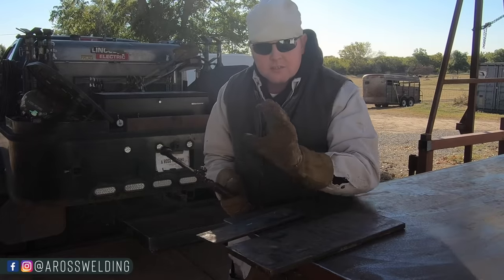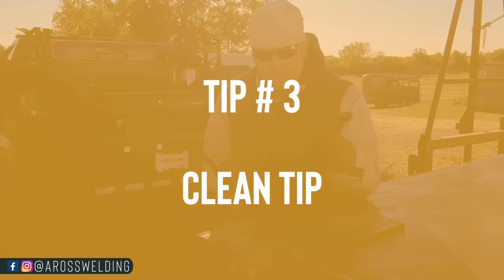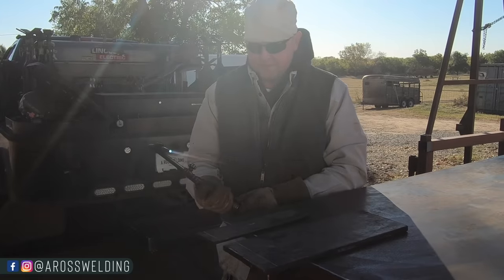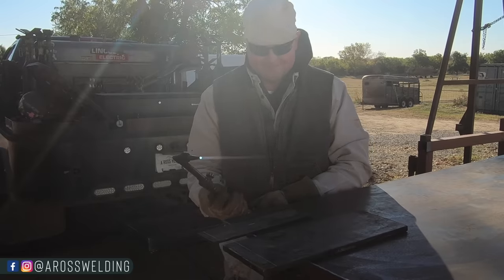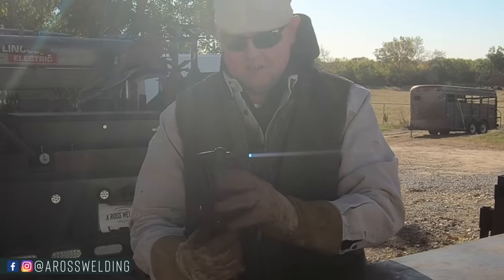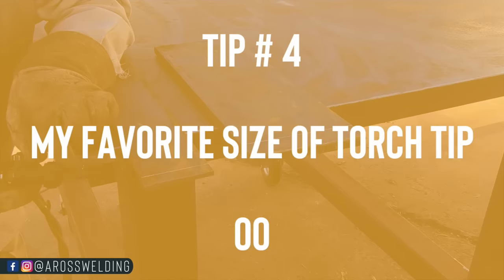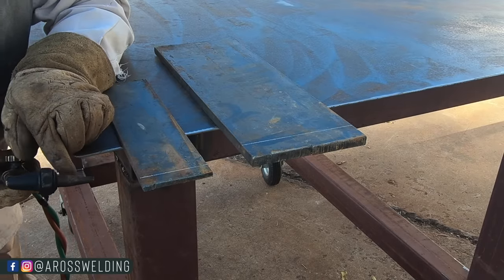Tip number three is one of my most important tips that I give anyone, which is a clean tip. That's going to save half your trouble all the way around — a clean tip. And tip number four is my favorite all-around tip, which is a double aught. Double aught just means two zeros, which is the first two numbers in your torch tip size. If you need more information on how to find your tip size, it'll be in that video linked in the description below.